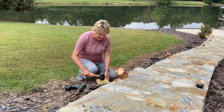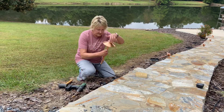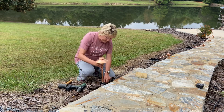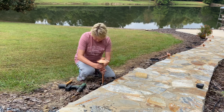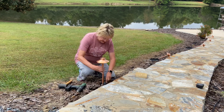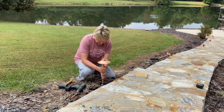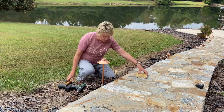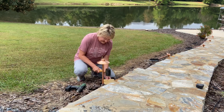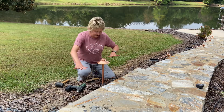We've got it pretty much almost into the ground — we don't want to go too far because we have to add the lighting. We're going to slip the wire in first and then go ahead and screw this down. It's really that simple to install. Now I want to be sure it's level, so I'll take my block and knock it just a little bit this way. Okay, that's the first one — we're going to come back over this with mulch to cover all the wiring and the end of the stake.